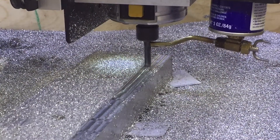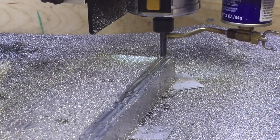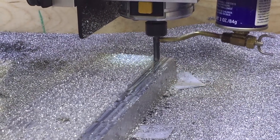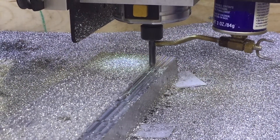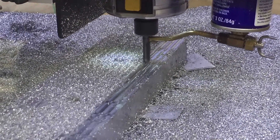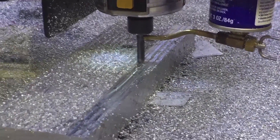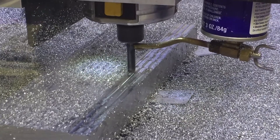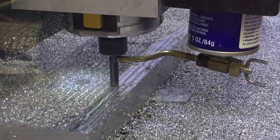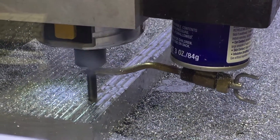You can see that I use WD-40 as a drip lubricant. I like the finish quality on aluminum when you use it — the aluminum comes out bright with no tearing and no scratching. It also allows me to leave the shop for hours and come back without a problem. It only takes a couple of drops of WD-40 to guarantee a smooth operation. Information on my holder will be in the description.